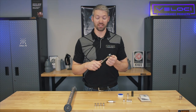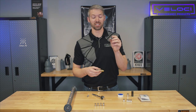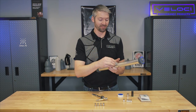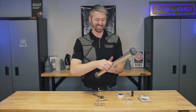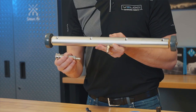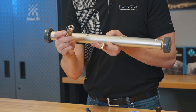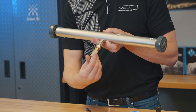So if you took the time to watch that sequence, we're now going to include a quarter-inch female coupler that you're going to want to thread onto the filter. Don't remove the plug — leave it in. If you already got it out, use your Teflon to reinstall it. Then you can clip right in. You're essentially going to have the same thing, only instead of having to remove the plug and thread in your pre-filter, you just put Teflon on the pre-filter threads, install your coupler, and clip in and go.